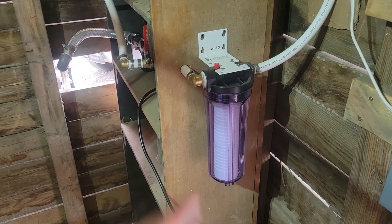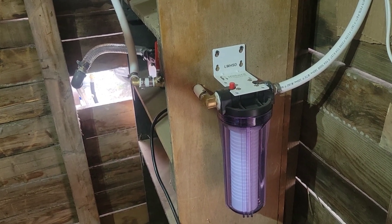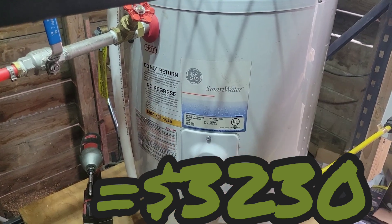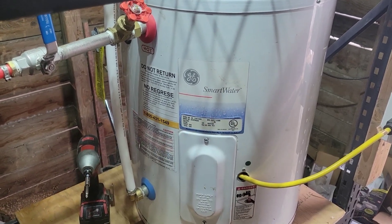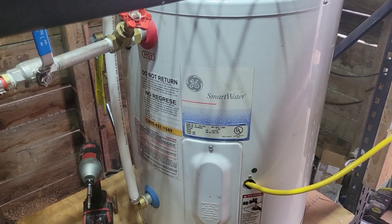On my intake side I decided to add a 20-micron water filter because I had it laying around from a previous project — it gives the dirty oil a little pre-scrubbing before I run it into the centrifuge to give the centrifuge an easier time. That's another 40 bucks. I also bought a used water heater for 80 bucks — it's a 110-volt unit holding about 20 gallons, picked up on Facebook Marketplace listed for 150, talked him down to 80. I figured a water heater would help thin the oil's viscosity before it goes into the centrifuge so I can run it in the winter as well as the summer.